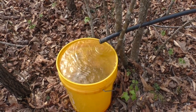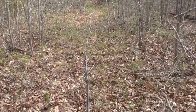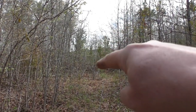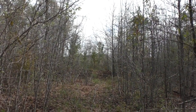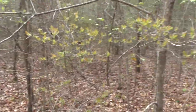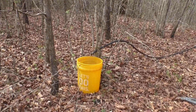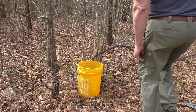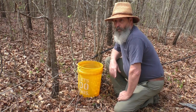Okay, that's the ram pump at 200 feet. I did run it all the way up there, but I had a terrace right in there. Then it went up to another terrace right in there, and then up to a 55-gallon barrel. So the 1/2 inch to 1/2 inch, just with this elevation gain, I had the hose at 325 feet, and it did not want to push it that far. So what I did, I just gradually started taking hose off to find out what the capabilities were of a 1/2 inch to 1/2 inch, and I probably gained at least that much, if not more, elevation.